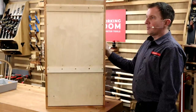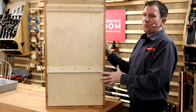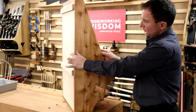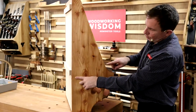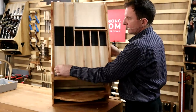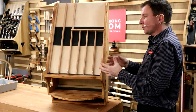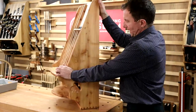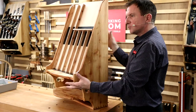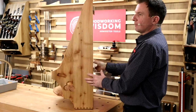Around the back: plywood back with two French cleats to make sure there's a lot of strength — there's a lot of weight involved. The plywood goes all the way to the bottom and up through. On the inside, there's a plywood triangle that fits in from here and comes up. So we made that as a box — the front here is screwed through onto that triangle section, and the back bit is glued on and fitted together. One thing I wish I'd done is a hole in here so we could have had a storage area inside using the bottom of the shelf. You kind of think about these things after the fact — I actually love that shape as it is.